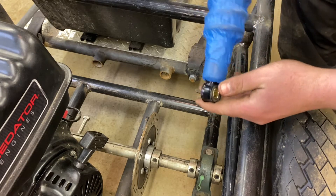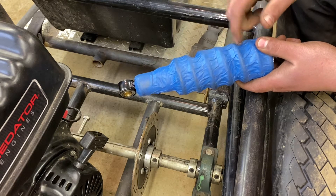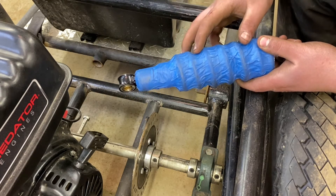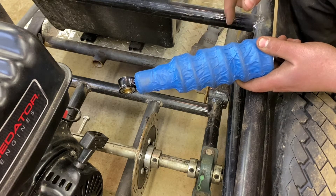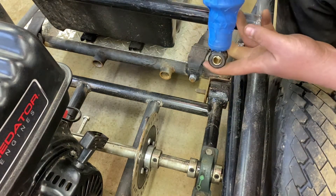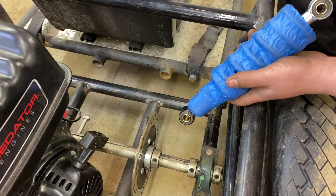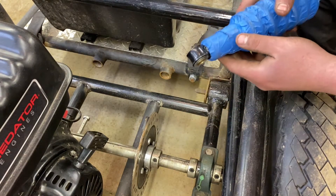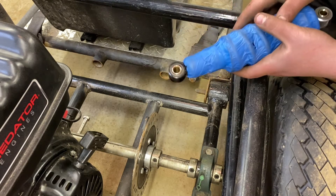This is basically going to be the new coilover for the back. I got these off Amazon. They are rated at 1200 pounds apiece, so it takes 1200 pounds of force to compress each spring. With two of them that's 2400 pounds to make these springs move. That's a little bit high, but I was searching for a shock that was about nine inches tall with at least 800 pounds of spring force. These were the only ones I could find, so I bought them.